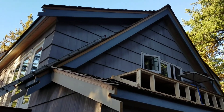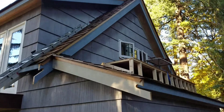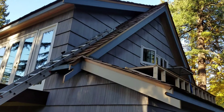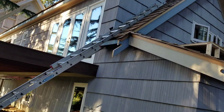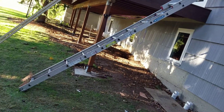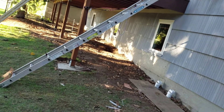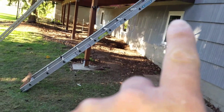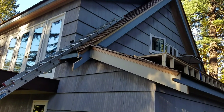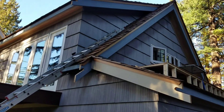That's kind of a hard one to get into. We have to lay a ladder over the roofing. We don't want to actually step on the roofing because it's cedar shake roofing. So we have a ladder with stakes in the ground to keep it from sliding out, and then it's got a couple of cargo straps to hold it — a cargo strap here and a cargo strap up there. Then you can climb up on the ladder, lay on the ladder and not on the roofing, and that way you don't damage any roofing.